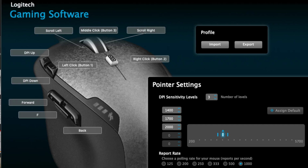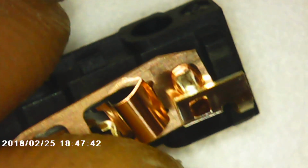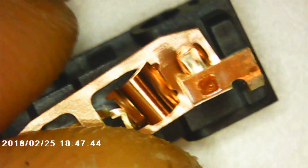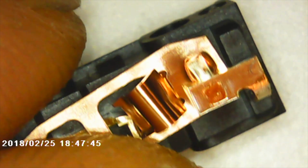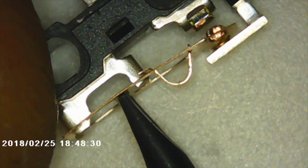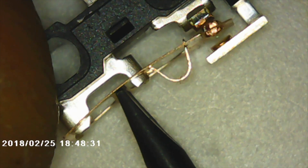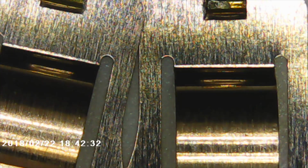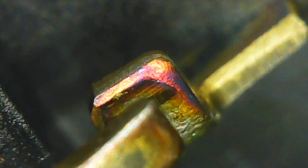That's one of the reasons I'm a proponent of open source, because we could have possibly fixed this years ago. And that's also tied into the construction of the switch. Obviously, these Japanese types with gold-plated contacts and the much larger contact area, as well as the much slighter rubbing action against two metals that are the same hardness, as long as you don't wear out those noble metals, is much preferable than the clicker plate with just this one contact rubbing against the hardened dissimilar material that, as you can see, is very, very rough.